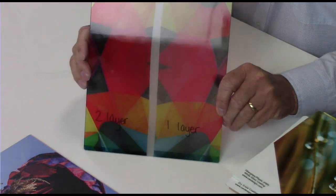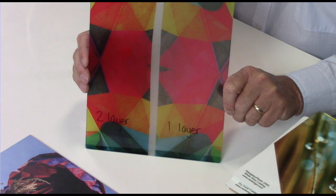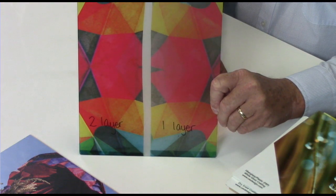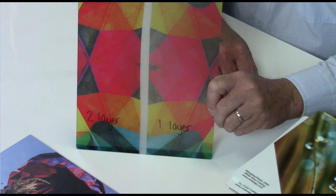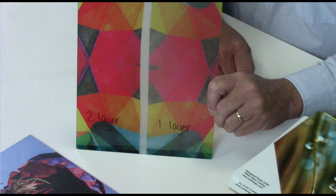All right, and I also have a fiberglass product that we tested. This is more translucent, so it has more of that rice paper look to it. It does have all the different textures in it. I was testing sublimating on it. Once I just did one layer of ink just to see how transparent it is, and then on the other side, we did two layers of ink. I printed this with our RT640 dye sublimation printer, and it comes bundled with ErgoSoft. Our profiles default to one layer of ink, but you can choose multiple layers just to have more density. That's what I mean by one layer or two layers. I didn't sublimate on both sides. It's just adding more ink. And with that, I wanted to show you guys something.